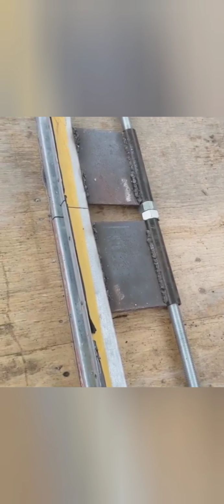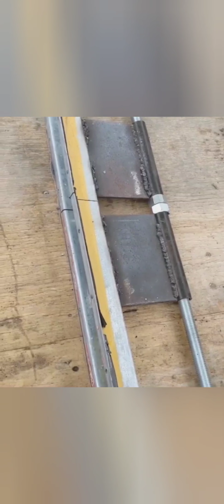This is what we used to separate and raise the roof. We left them just far enough apart that they could be cut, and then right over here we had a big roof jack. I screwed this 2x4 to there so that we could put our post. The post came down to the jack. But when I screwed it to there, it wasn't falling on anyone's head when we were jacking up and adjusting things. You could actually push the post over to adjust the whole roof. It was super easy. This is kind of how it worked. As we raised the roof with the jacks, these separated, and then all we did was just spin these guys down.